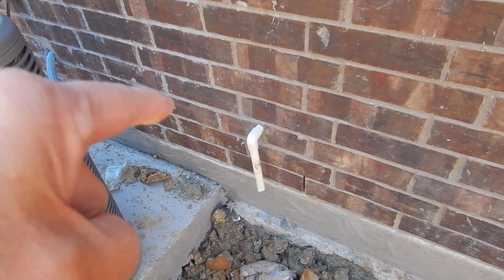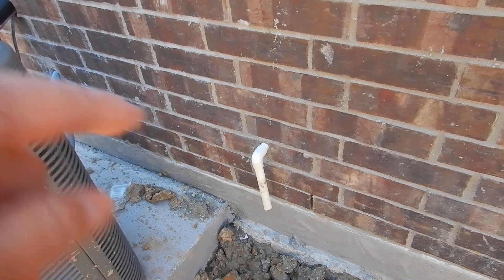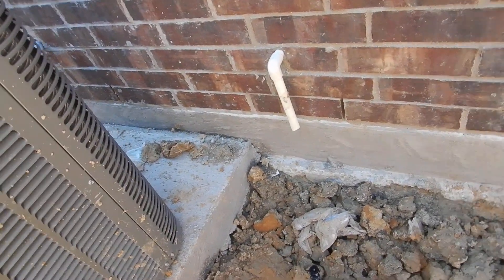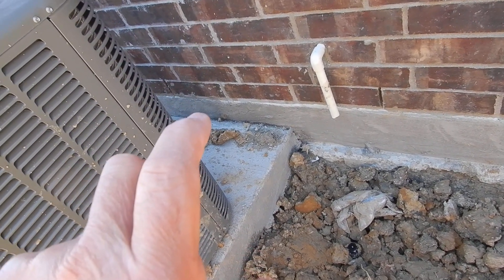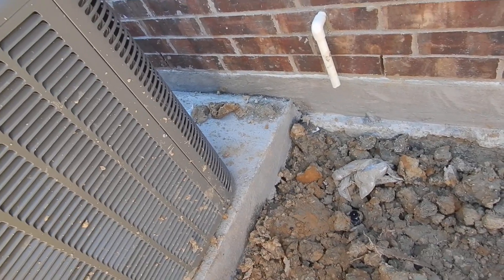This is the drain pipe for the water heater pressure relief valve. I say pressure relief because it's a tankless water heater and we haven't installed the turf yet, but I can see how low the lawn sprinkler heads are. It's higher than six inches from the ground today, which is too high, and it's likely to remain higher than six inches from the ground tomorrow.